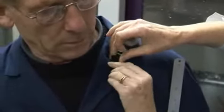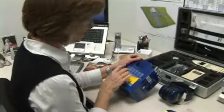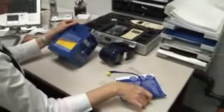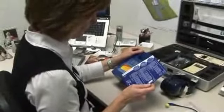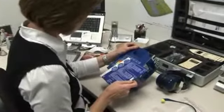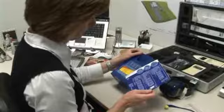Sound level meters, though, especially if they have the ability to measure the sound levels at different frequencies or octave bands, allow a more detailed analysis and investigation to be undertaken of specific loud events. The ability to measure the sound levels at different frequencies is also invaluable when selecting hearing protection. The assumed protection values stated by the manufacturers vary quite considerably at different frequencies.